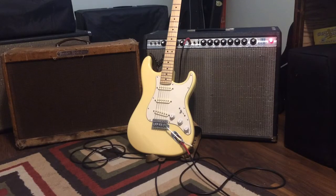Today I'm going to talk about a 1978 ultralinear Twin Reverb — the 135 watt ultralinear twin. It's got a push-pull master volume, two channels, two 12-inch speakers, and I believe one has been reconed. It's got mostly USA tubes in it. I picked it up for a smoking deal. It had a buzzing noise, and I adjusted the output tube balance pot and the buzzing went away. It needed nothing really — it's an excellent amp.